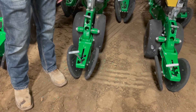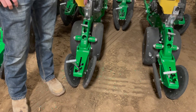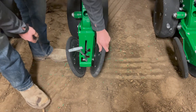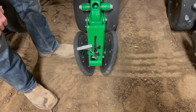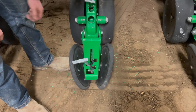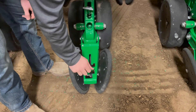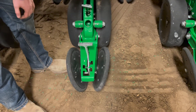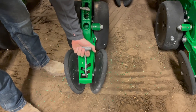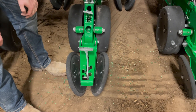Next, we're going to talk about the closing wheels on our row units. A good idea when you get to the field for the first time each year is to set the planter down, run it a little ways, and see how these closing wheel frames are tracking behind the seed trench. If these wheels are running in the seed trench, it probably isn't going to close it successfully — there's some adjustment here you can go ahead and make. You're also going to want to make sure that these bushings are good and don't have a big groove worn into them. On the spring downforce, sometimes these springs will start to get a little bit worn out, and if you're having to set them differently across some of your rows, it might be time to replace some of your springs.